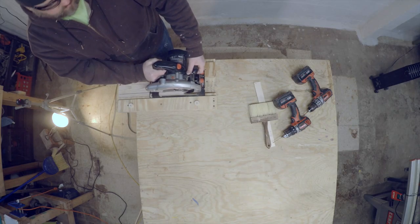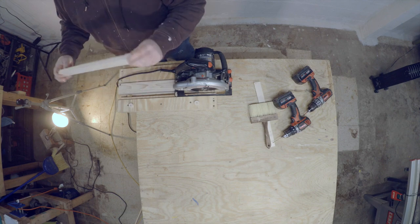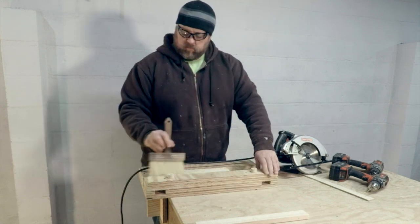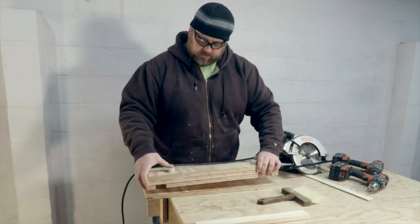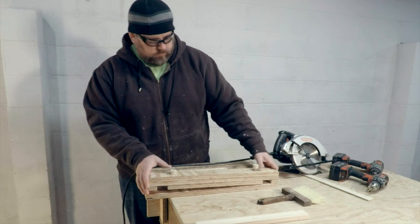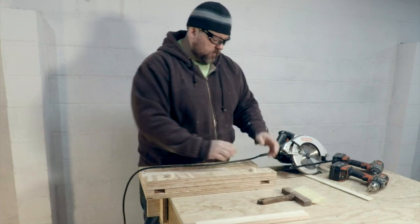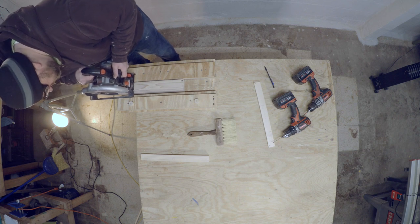Here we go making our first cut — this is for the bottom bar. I'm keeping the saw right up against the rip fence all along the length of the 2x4. I thought it would be a good idea to label these so that I don't get mixed up, especially if you're running these in batches, so that you know which is the top and which is the bottom. It's a good idea to keep your surface area clean when you're working on this jig. Just by moving this rip fence over, I have a preset and I can put these right back in the holes and we're going to go ahead and cut for the end bars. After you've run this a few times, these holes do get a little bit smoother. This is actually the third jig I was building as a prototype and as things progressed, the holes got a lot smoother and everything worked a lot better.